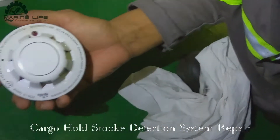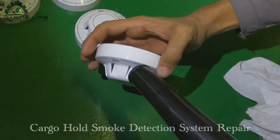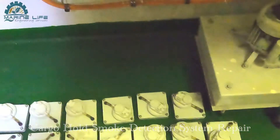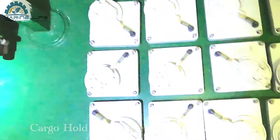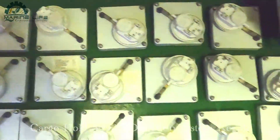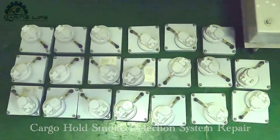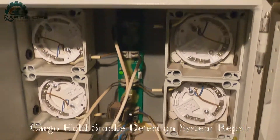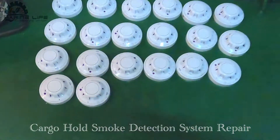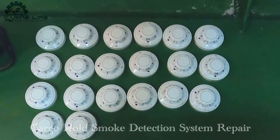Start cleaning outside and also clean inside using a portable blower because there is dust inside too. You have to clean nicely - when the system takes a sample, the sample should go inside the smoke detector, otherwise the smoke detector will not detect the smoke and will not give the fire alarm. Clean all the bases and the boxes outside and check all cable connections.